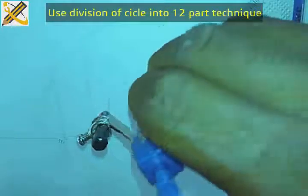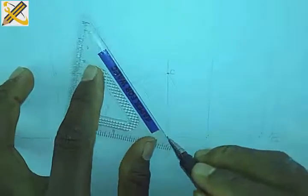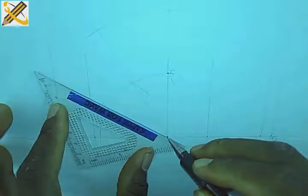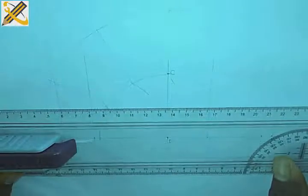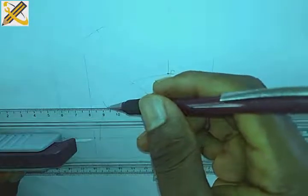get the point which I'm trying to do. Okay, so I am using the elliptical or auxiliary circle method. Yeah, I am using the auxiliary circle method to develop the quarter ellipse we have in here. I'm using the auxiliary circle method, all right.